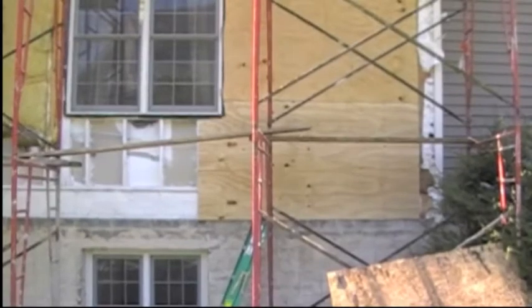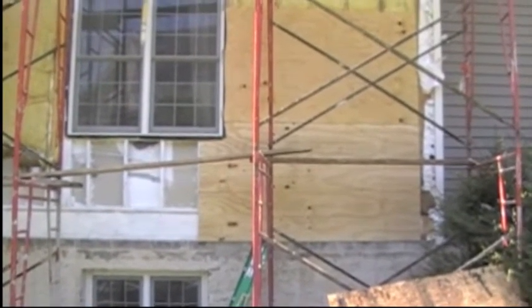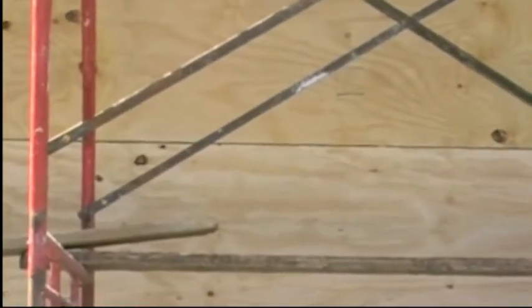See the water staining. We can actually go underneath the miter joint. We can see the mold growth and the water staining, and if we pan down, we probably see some additional mold growth there. At this point, we're starting to replace the sheathing with CDX exterior grade plywood. We're leaving the appropriate 1/8 inch gap around all sides. Very important for expansion and contraction.